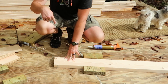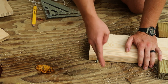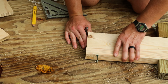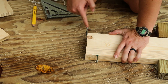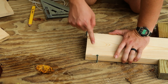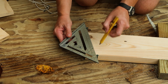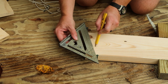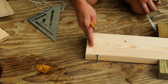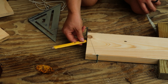My shop width is 14 foot, so I've marked at 7 foot here for the center line. I'm going to move my truss piece here so that the top is right on that center line. I've got a couple of screws sticking up here on the line. I'm just going to take my speed square on the outside here and just draw that line, and that is going to be the center cut I need to make for this one. Then we'll put one over here and do the same thing.